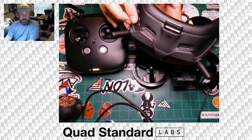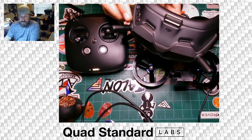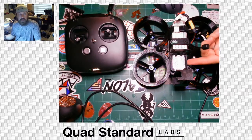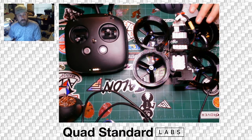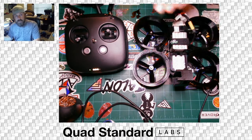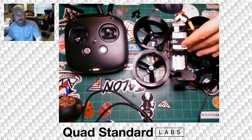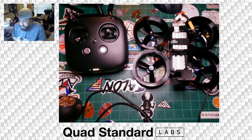All your access buttons are over here for recording, both on the air unit and on the goggles. It does not come with an SD card, so you'll want to insert one here in the goggles on the bottom side, and also on the air unit on the side of it. There is additional latency when recording on the air unit, so if you don't want that, only record on the goggles. If you're capturing video on the GoPro Hero, there's no need to record on the air unit. If you're flying without the Hero installed, go ahead and record on the air unit.